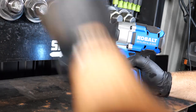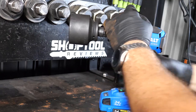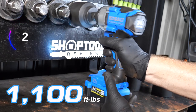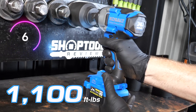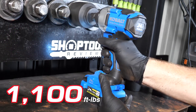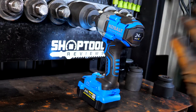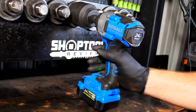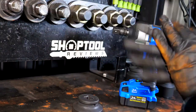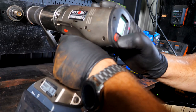I don't have a great indexing mark here, but staring at it for at least 10 seconds at 1,100 foot-pounds we got nowhere — that's our peak. We jumped to larger fasteners and were at 1,000 foot-pounds with the smaller ones, so I'm going back to retry. I'll go back and start at 900 foot-pounds to confirm, since I know there will be some skeptics.